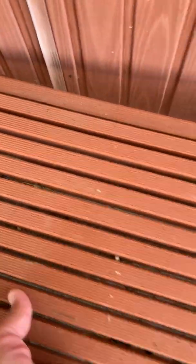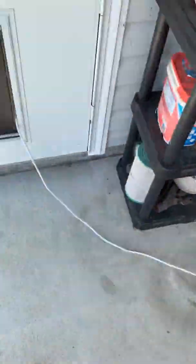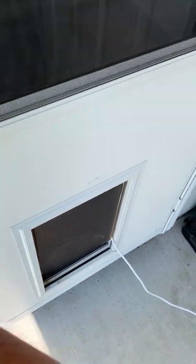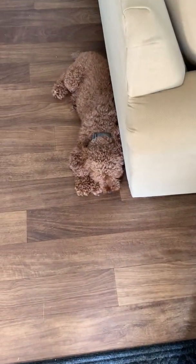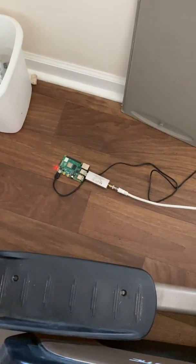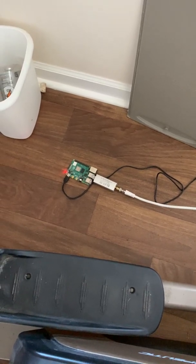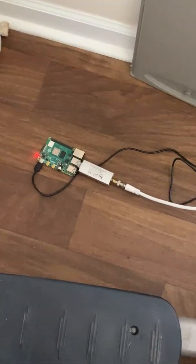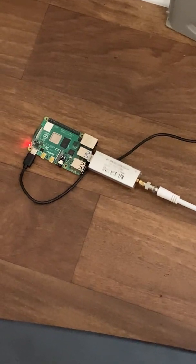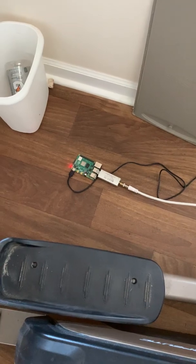I have it wrapped up in exterior antenna tape to keep it a little more protected so it doesn't get wet — it survived Hurricane Dorian, so it must be okay. That's my rig. All the coax is RG8 that I bought at Walmart. I pump this into a Raspberry Pi 4 with an RTL-SDR version 3, and I'm running it headless with a program called goes-tools.